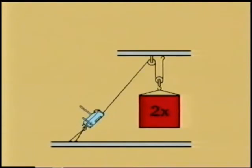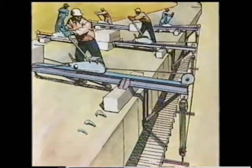The Tirfor is particularly suitable for this operation, since there is no limit to the length of wire rope used, contrary to the chain of a chain hoist, which is awkward to replace, and with the limits to the length of chain which may be used compared to the capacity, and contrary to drum winches, which have a maximum effective length of wire rope.